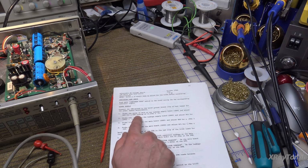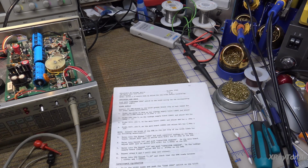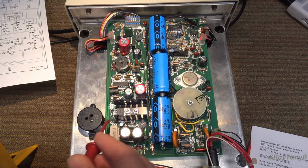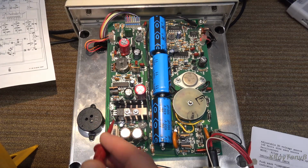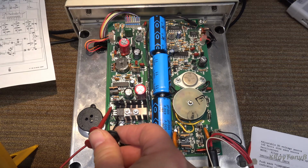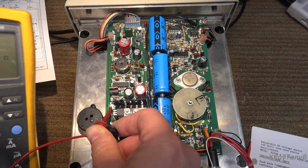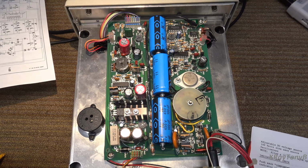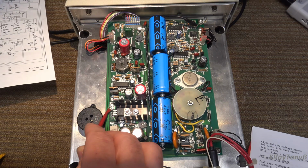So the unit's turned on. I want to look at CR16's anode, so it's a diode, and CR16 is this little one right here on the board. If you look at it, the anode would be right here, but you can see there's this test point TP1, and I checked it, and if you take the measurement here and take the measurement here, they're identical. Another thing we can do before we do anything, we'll kill the power, and I'm just going to do a continuity check from TP1, because they don't show it on the schematics either, to the anode of this here, and you can see it's pretty much a direct connection, with the exception of my poorly connected meter lead. So again, we can use that test point instead of trying to go in there.